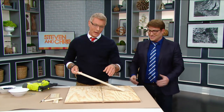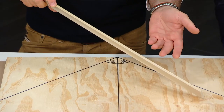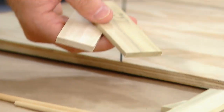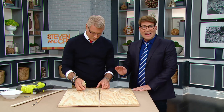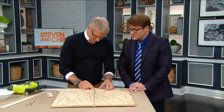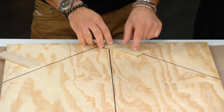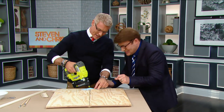We went to our big-box store and got these little two-inch poplar strips, which are fantastic. As you can see, they're quite thin — only a quarter-inch thick — and we cut them all down to six-inch strips, so they all have to be the same size. You could even go to a big-box store and see if they'll cut them for you. The first two that you lay in have to be exact; otherwise the rest of it will be messed up. These have to be exact — just the first two.